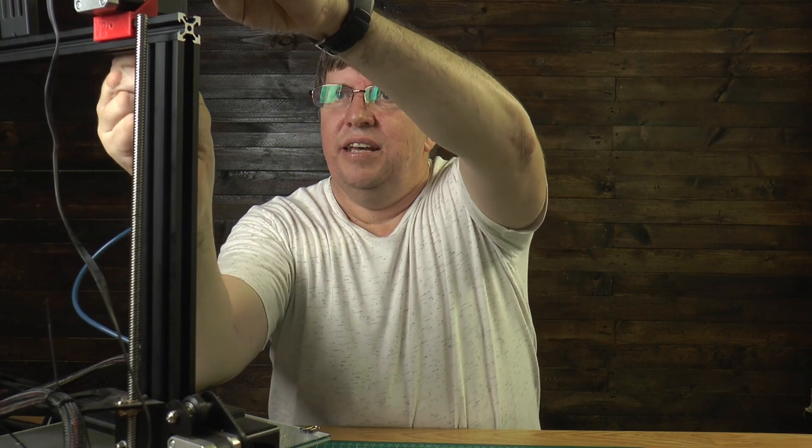Go do the e-steps and come back. Now I'm going to put my Bowden tube on — and this is another thing I'd suggest: get Capricorn Bowden tube. This Capricorn Bowden tube really limits the resistance of the filament going through the pipe. It is amazing stuff — absolutely incredible how much slicker the material is and how much better it is for your prints.